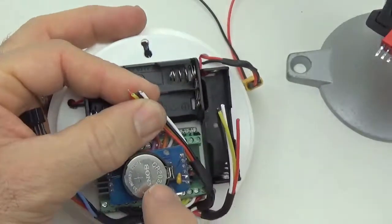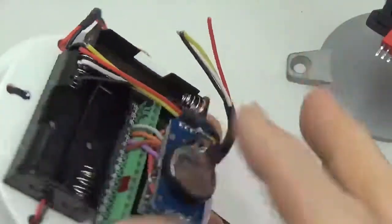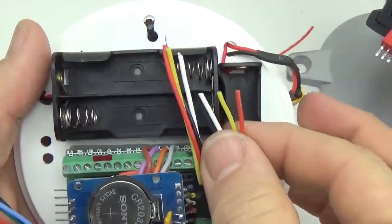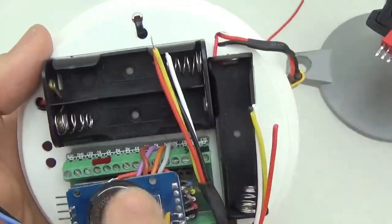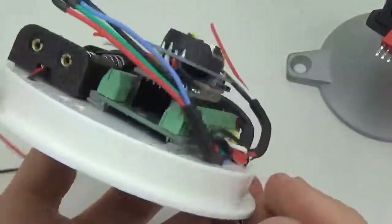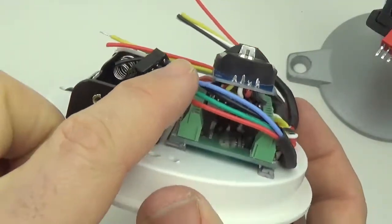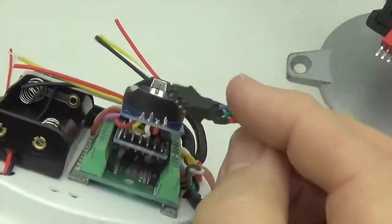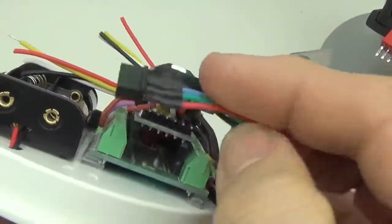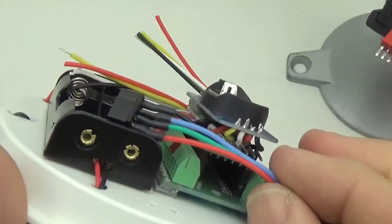But this is a fairly large vertical lump inside the housing, whereas this battery area is going to be flat. So there's actually sort of a lot of three-dimensional space over the batteries. And so I try and have my connections and all the extra bits, like the desiccant packs, for example, they all go here. It's just because of the topography. So you can see that I brought the LED connector over so that it occurs over here. Because if I was trying to make the connection here, it could get pinched between the housing and the vertical rise of the logger itself. So I usually bring the connectors all around so that they happen in this dead space above the battery.